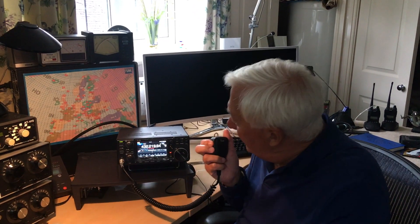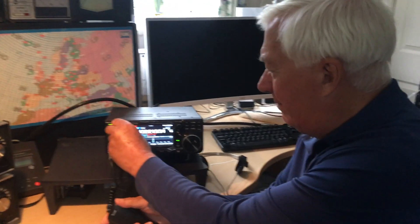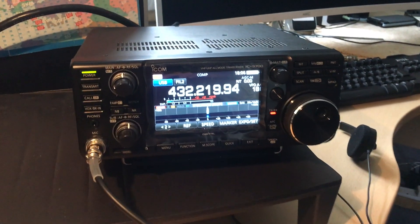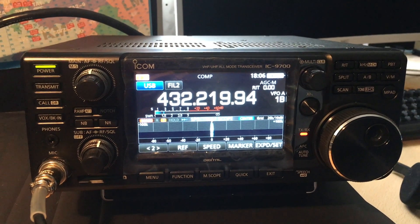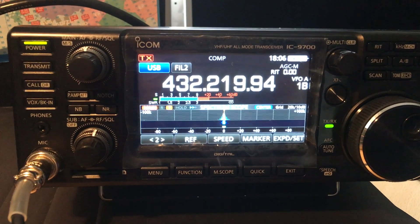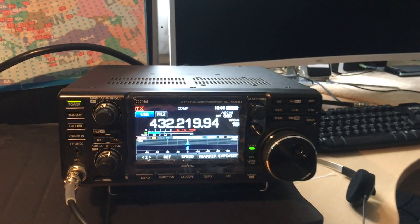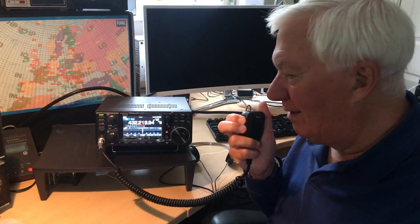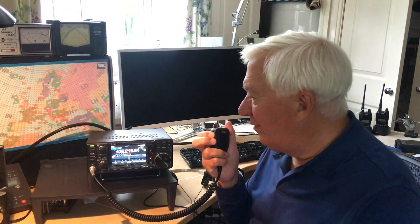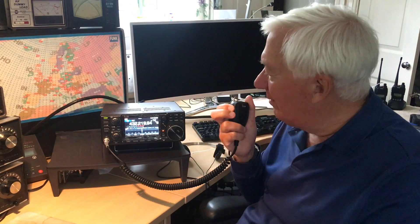So I thought we'd have a quick look on the band and see if we can get any stations. CQ, CQ, G3SED, Golf 3 Sierra Echo Delta, calling CQ70 and listening. Response from M0VMX - G3SED, hi Mark, M0VMX, G3SED. Just testing a new antenna, Mark. Would appreciate a report and how you think you're receiving me. G3SED, M0VMX, you're very, very loud Mike - you're at 25 to 30 over 9. Absolutely brilliant signal from yourself. That's great news, Mark - you're about the same, nearly 30 over 9. Thanks Mark. I'll do a few more tests with you later on with front to back. I'm just looking at the SWR which is about 1.3 to 1, so I'm happy with that.